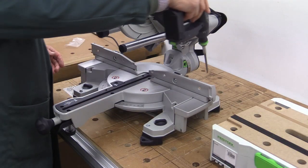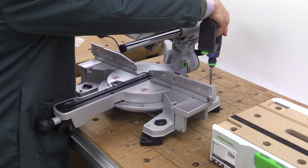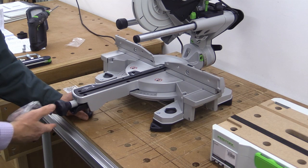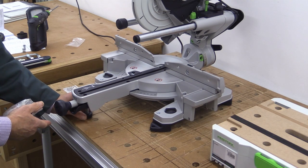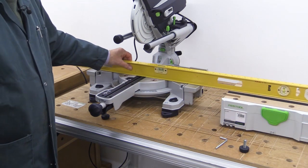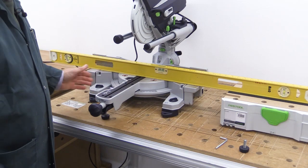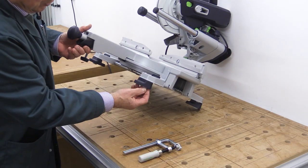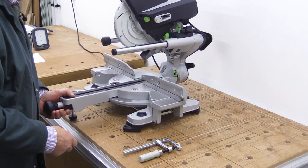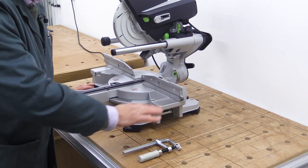And once you've got them loosely screwed up, you can then finish it off a little more quickly. And don't forget to adjust this support screw at the front here and get it so it's just right. And I hope you can now see that for all practical purposes, that is pretty much all in line. Now, if you allow these little rubber feet under here to slip down into the holes on an MFT3 or something similar, then don't forget you're going to lose that height equivalence with a SIS1.